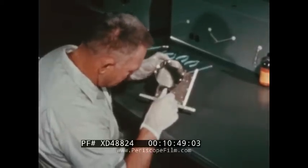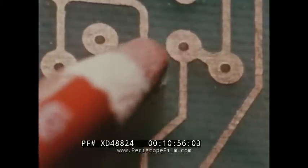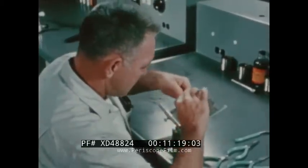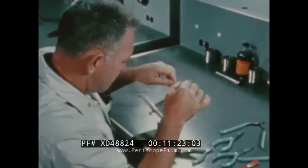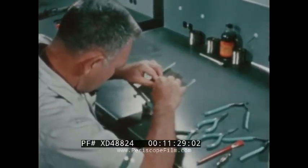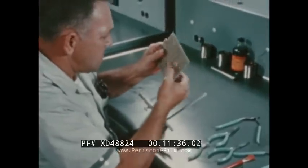This board is okay, so Harry prepares to solder. Just before soldering, a pencil-type eraser is used to clean the pad. When cleaning the wire, he uses two typewriter erasers between a staple puller. Mac, too, is gradually learning that proper tools are important. Now Mac thinks he's all set to go. If you want to see the wrong way to go about it, watch this man of experience. He's cleaned the wires, but he puts his dirty hands all over the wire, nullifying the work.